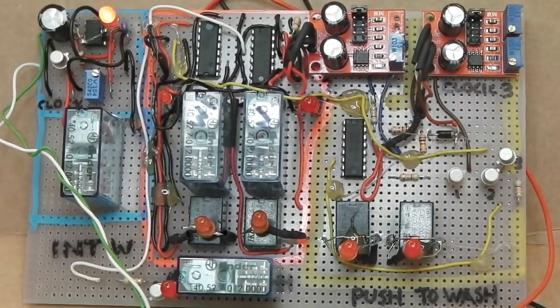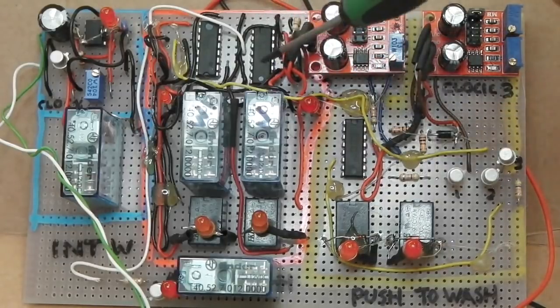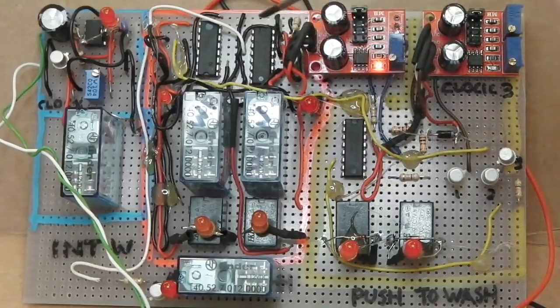It doesn't actually follow the exact Knight Rider pattern, but you can make it do that, because you can use these to do LED flashing lights on Christmas trees, whatever you want. The totally universal chip, to get it to come back on a Knight Rider, you'd have two chips, one wired the other way round. This one goes up and then it goes back to the beginning, so you don't get a back sweep. But that's all that's doing.